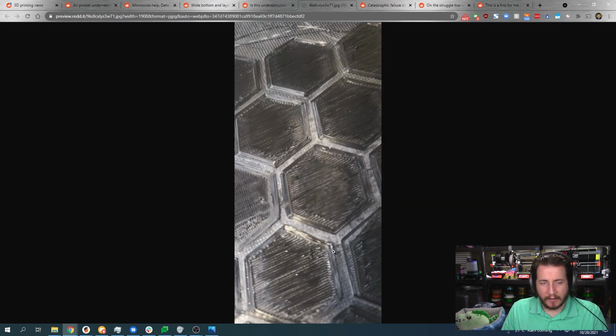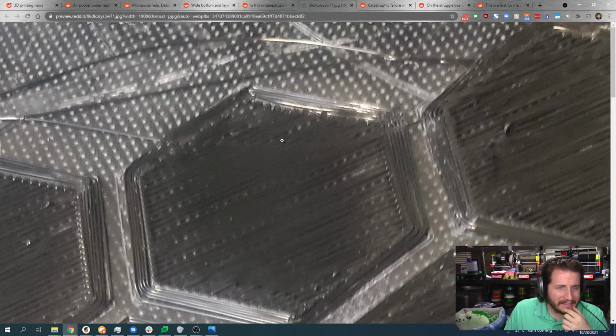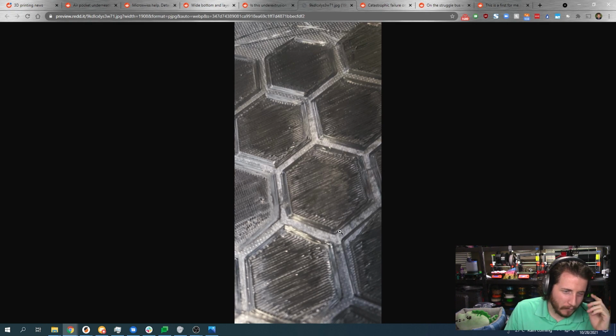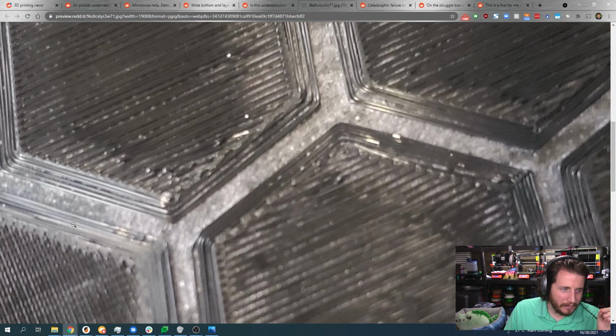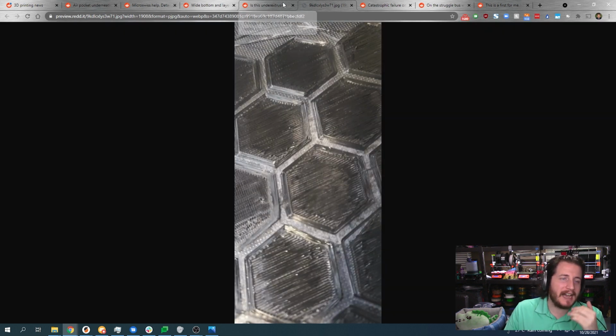It looks like there's some glue or adhesion promoter here that is absolutely going to adjust how things work here. And that adhesion promoter can really cause some problems here. We're seeing that it gets a little bit better as the bed goes back. So you could have a bit of a warped bed. And we've got, okay, yeah, we've got a part there. It's the same issue. Your bed's not close enough. It can be level all damn day. This is not a level problem.